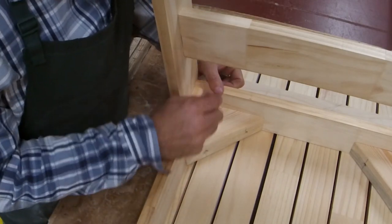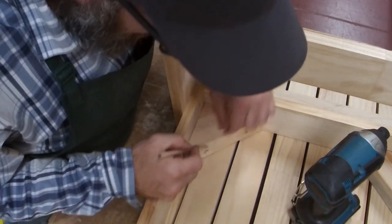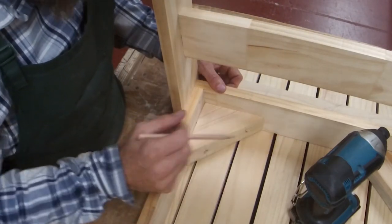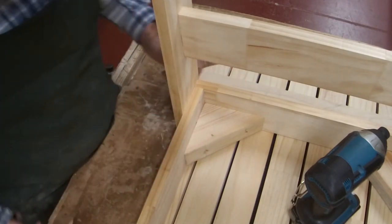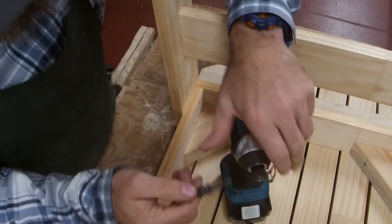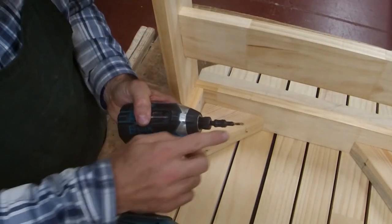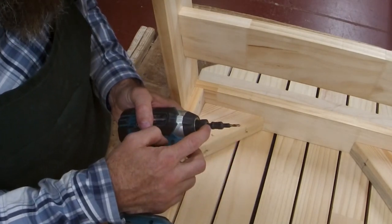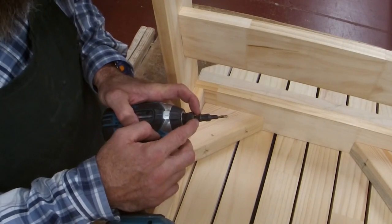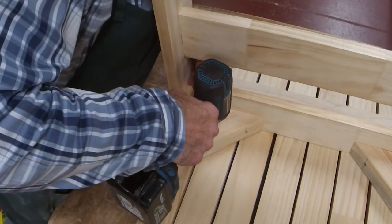So make sure you can't be too close to the corner, because I need my drill to fit, but I don't want to hit the screw we've got in here, and I don't really want to hit any of the rails with the drill. So it's got to be somewhere around there. Because I've done it a few times now, I know the distance I've got to put the countersunk bit in is pretty much to the end of the bigger shaft section just here. I know that from previous experience, and I'll show you how to check it later. Nice and straight.